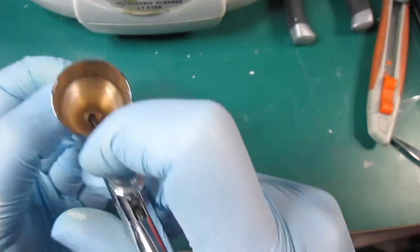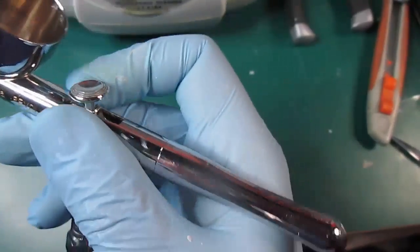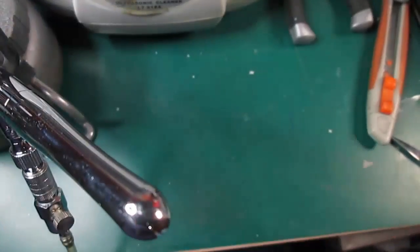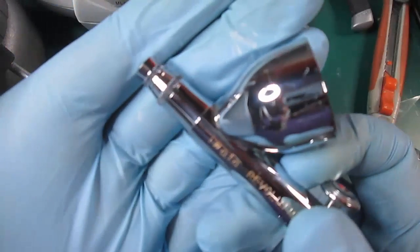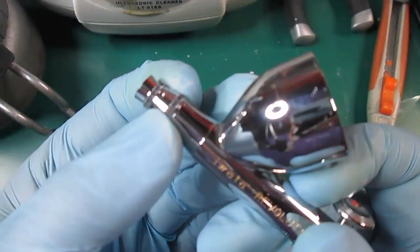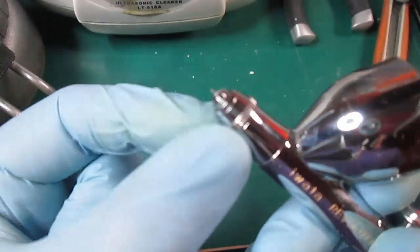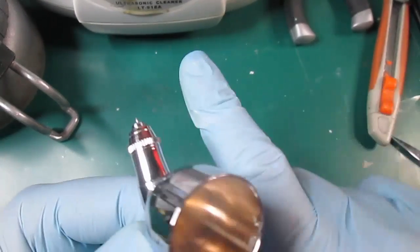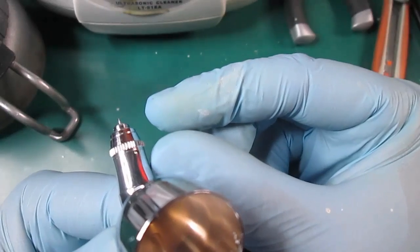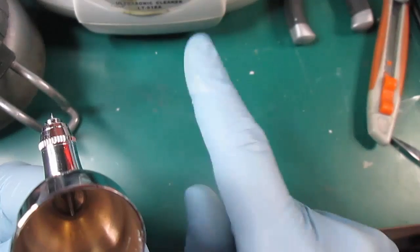There's nothing in there. Lovely. Right. Just put you there. Turn you off. And that's done. Right. This conical bell here, in this middle section, take you off. What happens is that tiny little air hole that I showed you a second ago, in this conical piece here, there's a gap. It's not much, but there's a gap. It forces the air in a tight spiral. And that's the whole point of that shape.